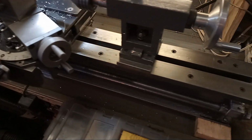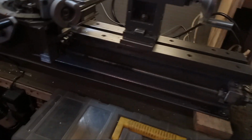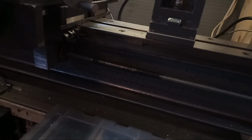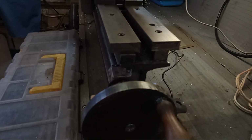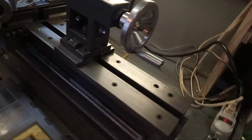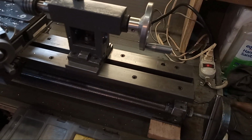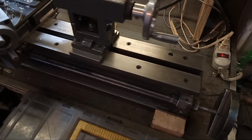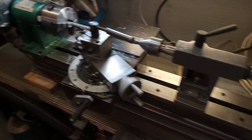The rails were simply 1/2 inch by 1.5 inch cold rolled steel with 1/2 inch by 3/4 inch cold rolled steel underneath and bolted in all the way through. Again, had a heck of a time tapping that I-beam. I broke 4 decent taps trying to put the thing together, but such is life.